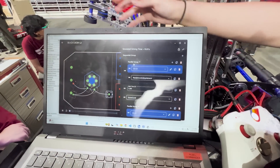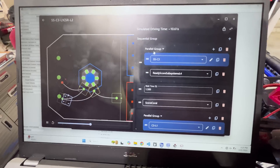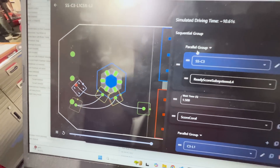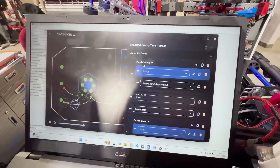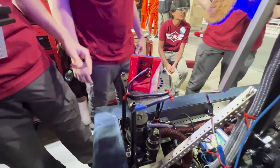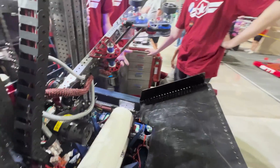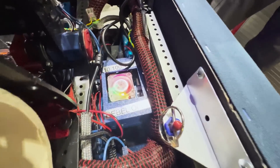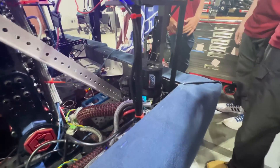I'm assuming those four little blocks are your swerve modules, and these cameras on top of every single one of them? Yeah, these are our swerve modules. The cameras have been optimized for our autos — the angles are all tuned. They run off two OrangePis, which we plan to use for object detection soon. They both use PhotonVision, and we just calibrate them — they're simple cameras that report data and adjust the odometry based on that to interpolate our poses.